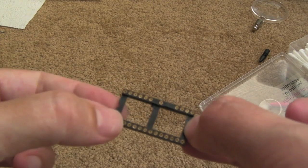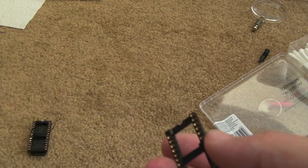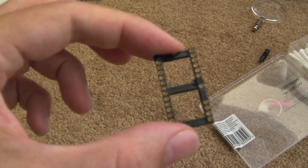The main thing is to isolate here because even though the solder is quite low profile on these, when the sockets push right on it will — if you're not careful — make a connection. That's why I want to isolate the individual pins with a bit of masking tape up the sides and just over the actual individual pin width. Not particularly elegant, but you can see it's masked off the one or two pins that I don't want. There's one on this side here too, so I'll just do the final one and then I can start to join it all up.